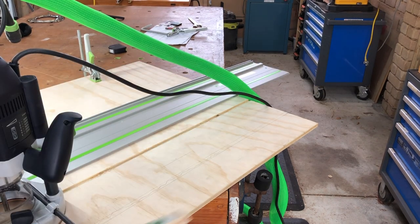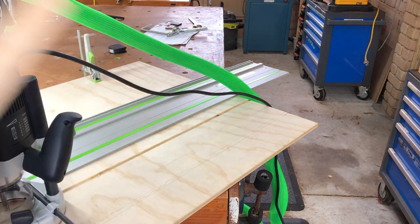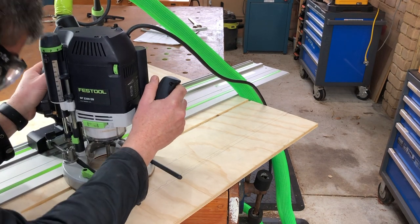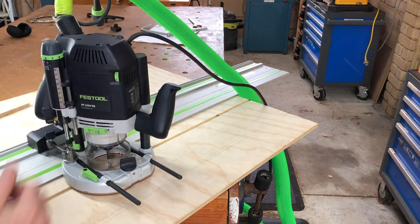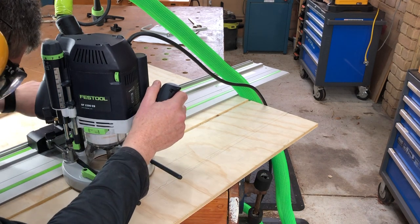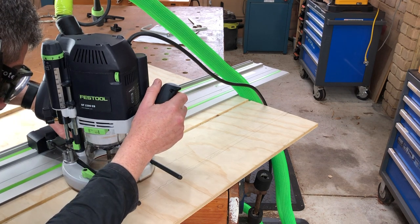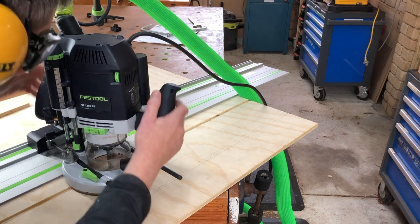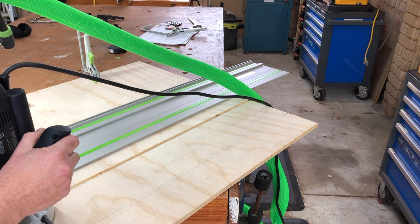Take the test piece — sure enough, it won't fit. So we sneak up on the line a little bit more. The blade has stopped the right way — that doesn't happen often! Loosen off the knob, adjust the green knob, slide it over a little bit, tighten the black knob, release the cowl for dust extraction, and away we go.